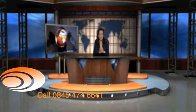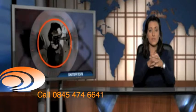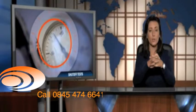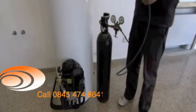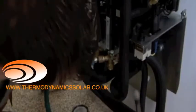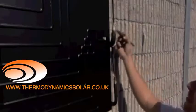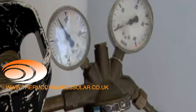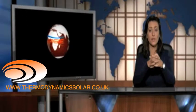After all connections have been made, the panel and connecting pipes should be subjected to a pressure test to ensure there are no leaks in the circuit. Note that the pressure test is only carried out on the pipe and panel because the thermodynamic block is already pre-loaded. Carry out the nitrogen charge through the pressure socket of the three-way valve at a pressure of 12 bars. Wrap all connections in soapy water — in the event of leakage it will be perfectly detectable. Read the nitrogen bottle manometer and check that the reading has not moved to confirm there are no hidden leaks.